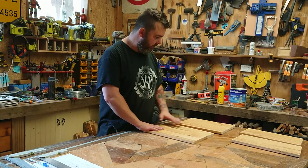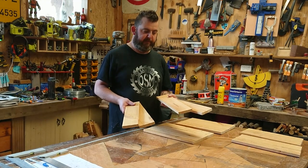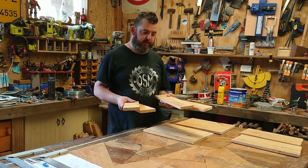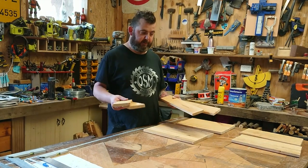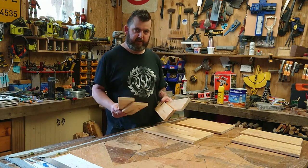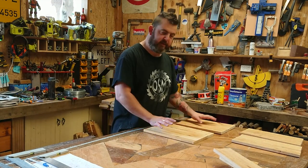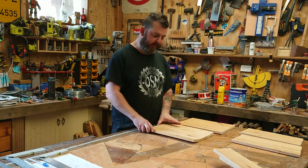We've got our back, our front, and our two sides. And then this is the timber for the base and the lid. The reason why we won't cut those just yet is because if you're anything like me, your cuts aren't accurate, especially if you're using a handsaw. So we won't cut those until the box is put together so we know exactly what size we want it to be, just in case things are a little bit skew-whiff. We need to cut some small pieces as braces to help pull this all together because they're all single pieces since we are using pallets.